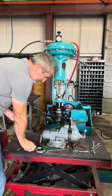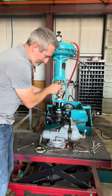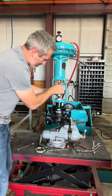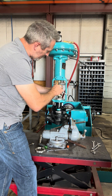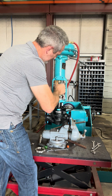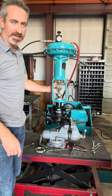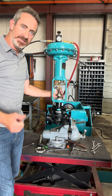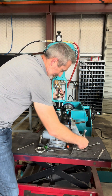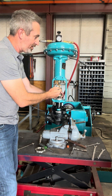Back around to this side, put my blocks on and tighten them up. Now you're going to notice that the travel indicator is no longer tight against the stem blocks. So now you're going to spin your jam nuts — run the first one up against the travel indicator and it's going to run into the connecting block. Take your three-quarter inch wrench and jam it. It doesn't have to be super tight, you just want to jam it against the connecting block.